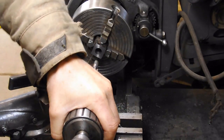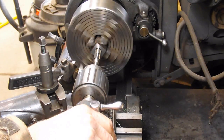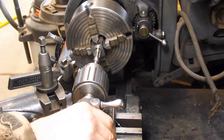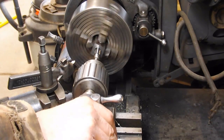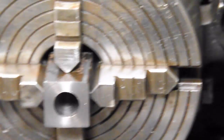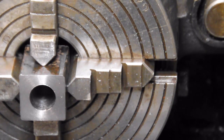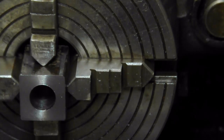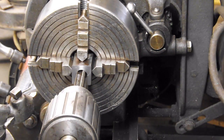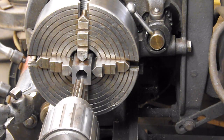Not seating — because the camera's on, of course. I think you get the idea. Hopefully that will be a 37/64ths hole and I'm about 2 thousandths off — just about 2 thousandths tight. So I'm going to try the tap and see if it goes. I'm not sure if I'm feeling brave or stupid, but I'm going to try tapping here under power, in back gear. I don't think this tap is very good, so this may not work.